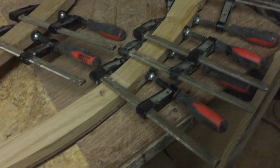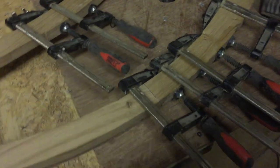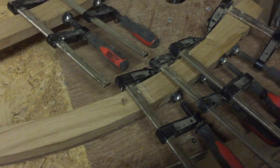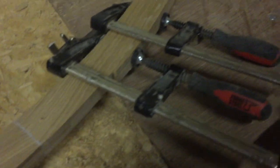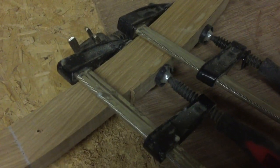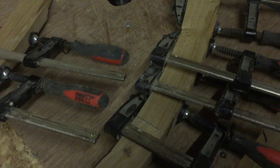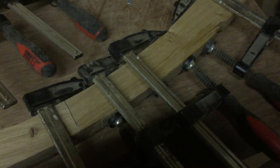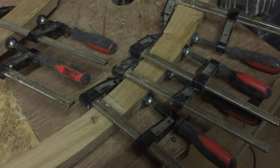Good morning everybody, it's 7:30, Tuesday the 12th. I've just come into the workshop and those last couple of bits I was routing up for the top frames — we had a problem yesterday. A couple of big chunks split out when I was on the router. This fierce router bit caught the oak and pulled it out — the worst breakout I've had doing all the routering. I glued them up last night so I can hopefully just finish them off and put them onto the frames. Quite mad that on the last bit of curved routering work we have a mishap.